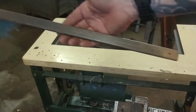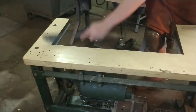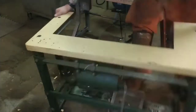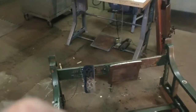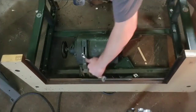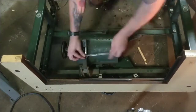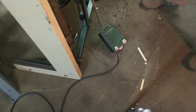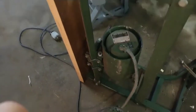All of this trim is broken so I'm just removing it, pulling all the nails — it's all junked up. I'll probably cut some wood to fill in where that plastic trim was. Just dusting everything off and being a little cautious, because with something like this you just never know where a needle has gotten hidden — you don't want to blindly wipe something down and catch a needle right in the finger. There's that big massive three-phase clutch motor — by far the heaviest part of this machine. It's got a bracket, and then there's just one little cotter pin to pull and it comes right out.